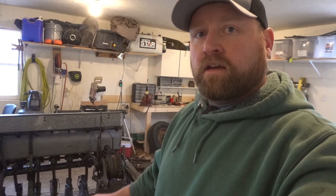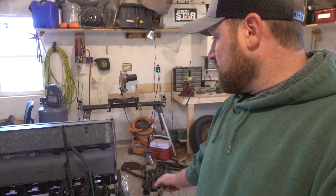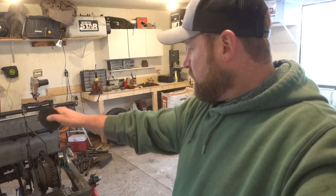This unit is going to sit outside for a little bit. Before I got to the point where I decided what I'm going to do here, you need to determine whether you want to make two drills out of one or one drill out of one — and that's a big decision factor. When I actually did the splitting and finally just went for it, all I really used was an angle grinder with a cutoff wheel. I did a little bit with a sawzall, but this actual galvanized steel is probably 16 gauge or about 1/16 inch thick — it's pretty thick stuff — and the cutoff wheel seemed to work a lot better. I just measured off, went down, cut it, grabbed the pry bar, and supported it up, and as luck would have it, it split apart.